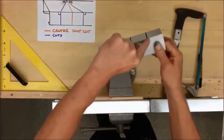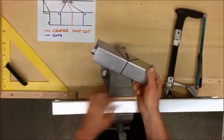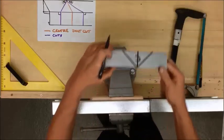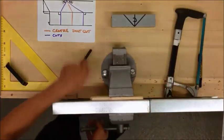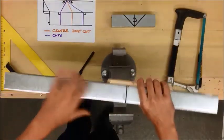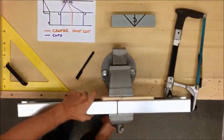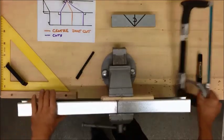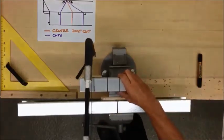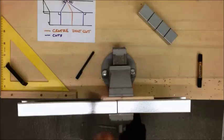So I've cut down this line and all the way down this line to that point. We do not cut that back edge, that will become our bend. Move the timber along to support my cut so this is not moving. And the same again — if you're less confident, cut on that line, then cut that line when you turn the piece around. In my case, I'm going to cut both at the same time.